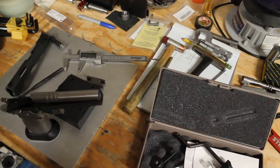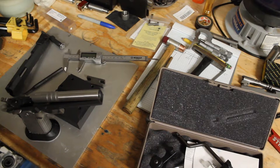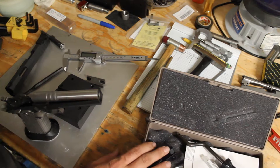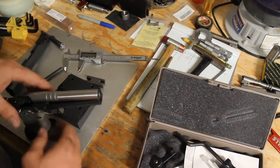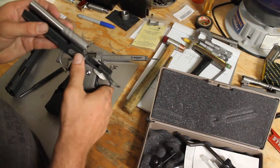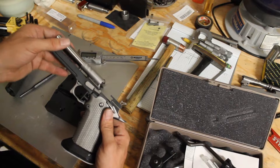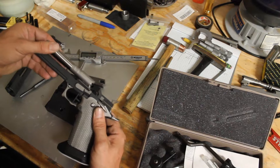Some of you have done this before and are probably wondering why in the world I was putting that link in when I knew I was going to use this lug cutting kit — you don't put the link in to use it. What I was doing was simply installing the barrel into the gun to give a graphic representation of what's happening before we cut the lugs. Here we have my 2011 competition gun — I haven't cut the lugs yet, and you can see this barrel wiggles around but can't go anywhere and is not moving. We need to cut the lugs so it can move up and down in the down stroke. We also see the feed ramp is positioned correctly in the frame — that makes me happy for reliable feeding. In the down-link position I see the correct declination in the barrel.